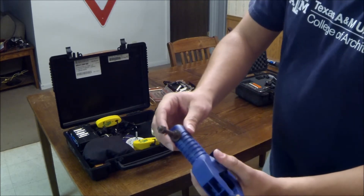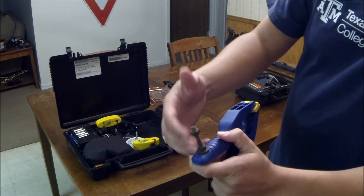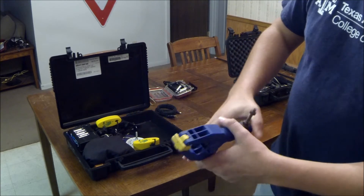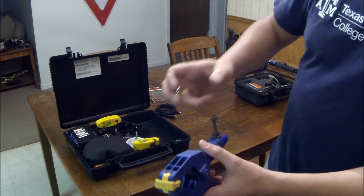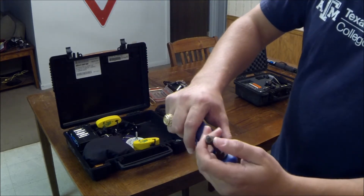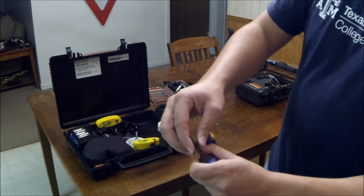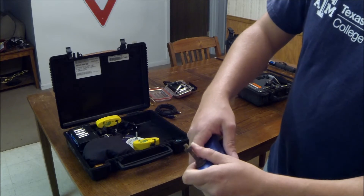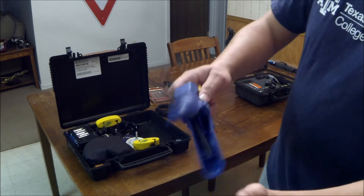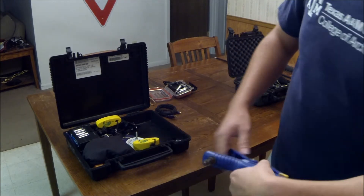Put a quarter-twenty up in here, and I figured out that with quarter-twenties and using the tripod mount, it's good to have an extra nut on the top. Because you're going to be putting this on different things at different angles, and the way the tripod mount works is it's not really secure unless you crank it all the way down. This allows you to put the camera in the direction you want it facing and then tighten the nut under it to keep it relatively secure. It's not good for anything involving shock because this loosens up pretty easily. It might be better with a lock washer or lock nut — just keep that in mind if you try to make one of these.